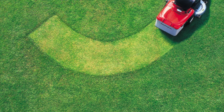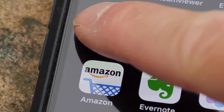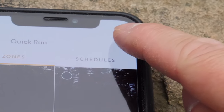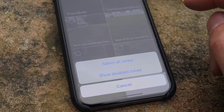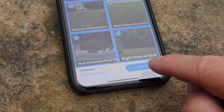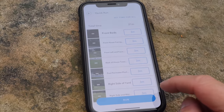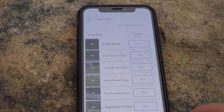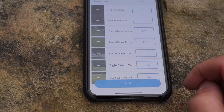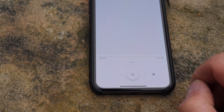Don't tune out because I'm going to show you both ways so that anybody can close their sprinklers. From the iPhone, we're going to launch the Rachio app, then choose the three dots under Quick Run. There's a great option there — Select All Zones — and now you can activate all your zones one at a time. It's preset with a three-minute run time, which is really perfect to close sprinklers. I run each sprinkler for three minutes to blow the water out of the lines.